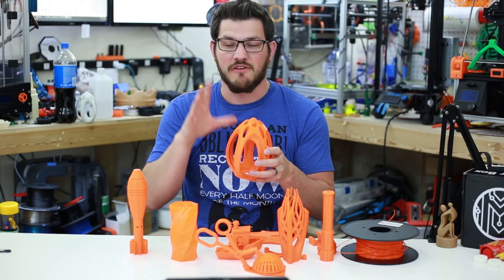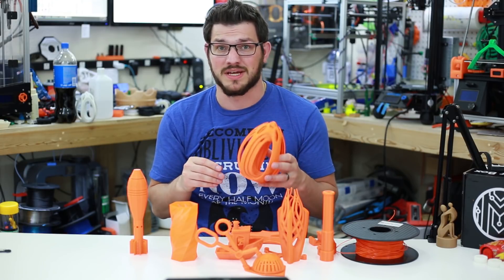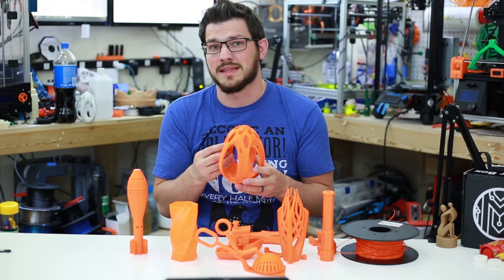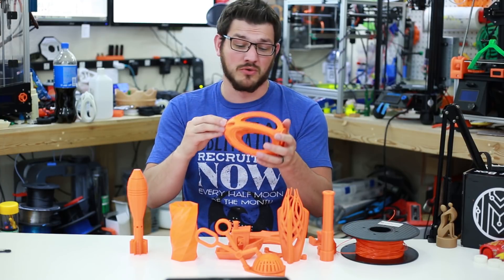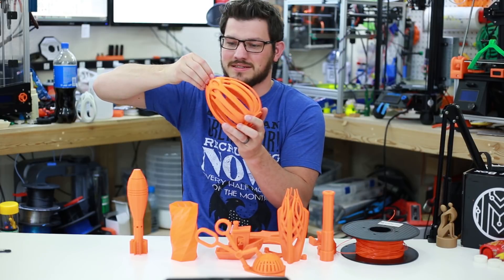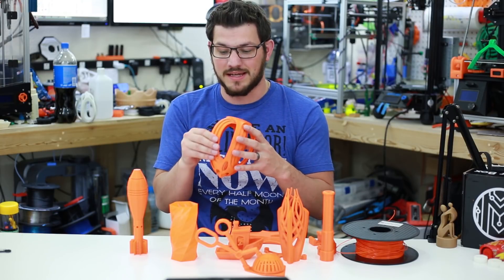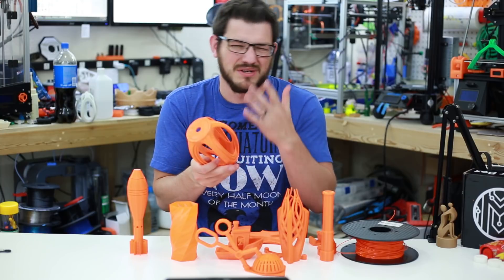None of the top was bound at all. His 100% model is really small and none of my printers are tuned well enough to print it at 100% — I also lack the patience to print PLA at anything less than 60mm per second. It was a very cool thing to test. PETG is very slippery because it's a very glossy filament — a lot of people actually use it for bushings because the finish is so glossy it glides over things very easily, almost self-lubricating.